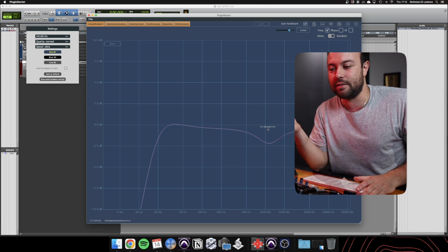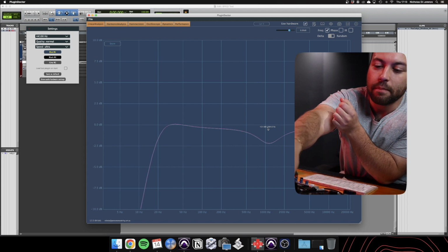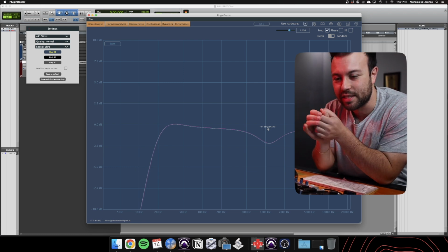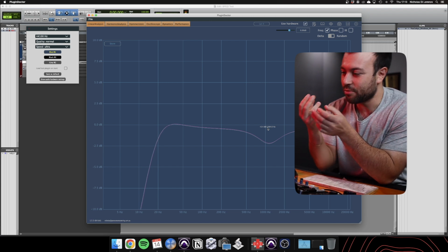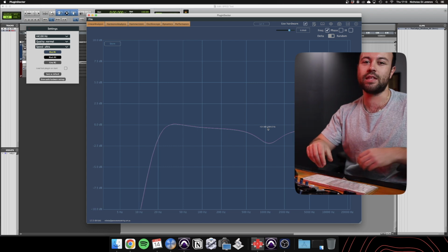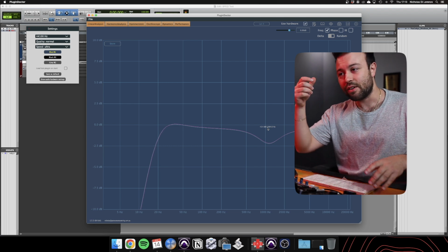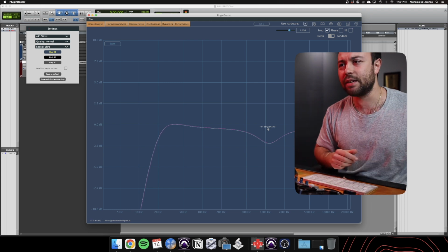I would get in sometimes like arguments with people in forums because I would call these switches, rotary switches, and they're like, no, they're stepped pots. And it's like, no, a potentiometer is a variable resistor. And even if it's stepped, it's still that one winding of the resistor. It's just, no. Rotary switches, potentiometers, 2 different things. One has many different resistors you're switching between. Another one is a single resistor that is varying in resistance as you turn it. So anyway, we got through that rabbit hole.